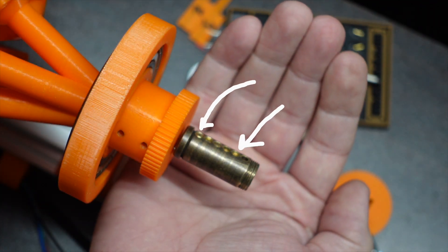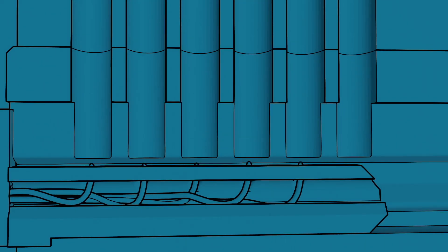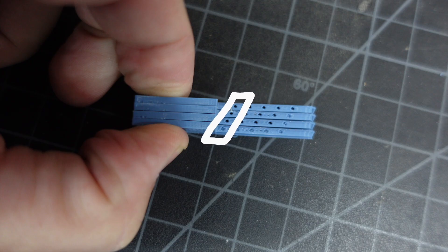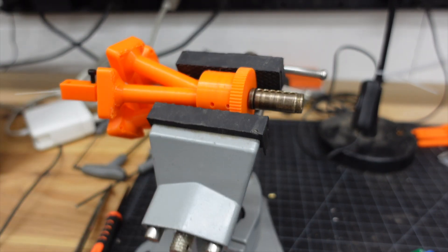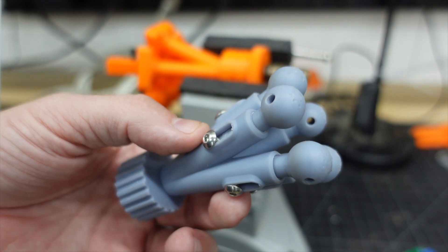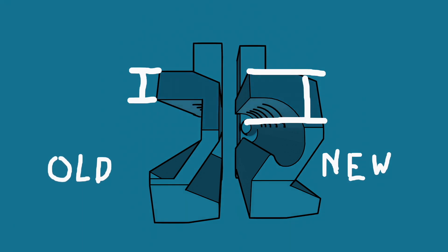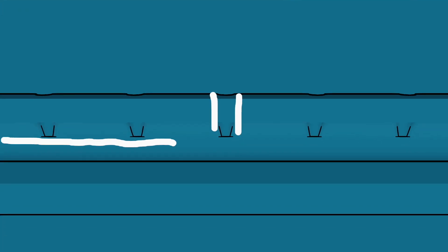I made a few changes to the key blade to make it fit in the tumbler tighter, but now it can't push the pins out. After a little bit of debugging, I realized the wire wasn't going the way it was supposed to — instead of going straight up, it's going at a really weird angle and ending up at the pin next to it. After weeks of trial and error, it occurred to me that the original one worked fine. Jumping into Fusion to compare the designs, it turns out I had made the top of the blade thinner, which changed the two points of contact where the wire rubs, changing the path of the wire. So we're going to copy the thickness of the old blade to the new blade and that should straighten it out.